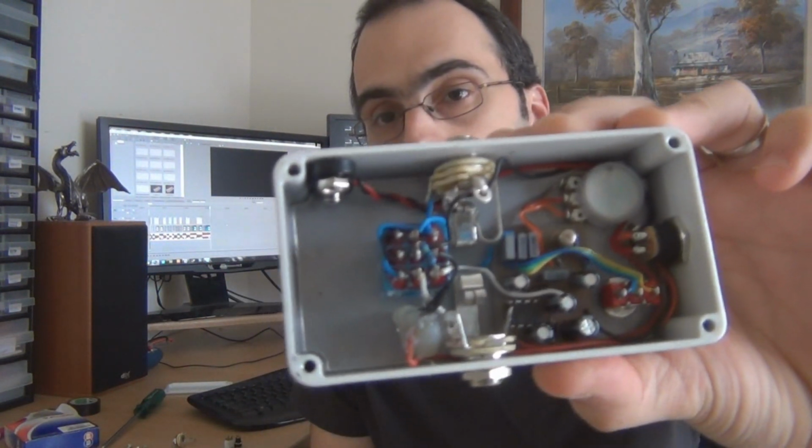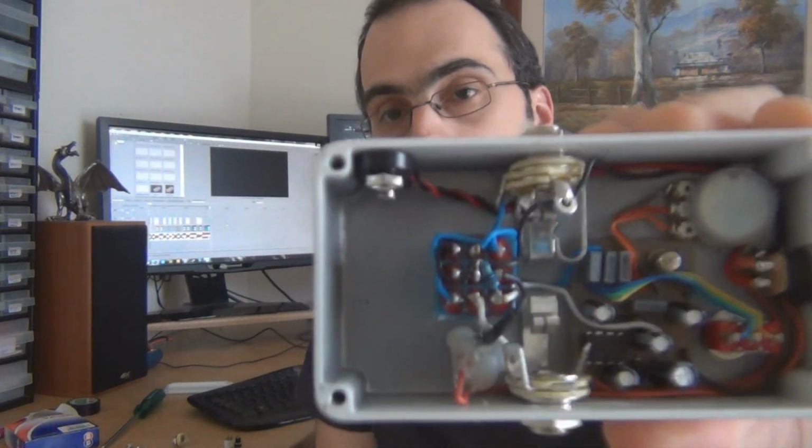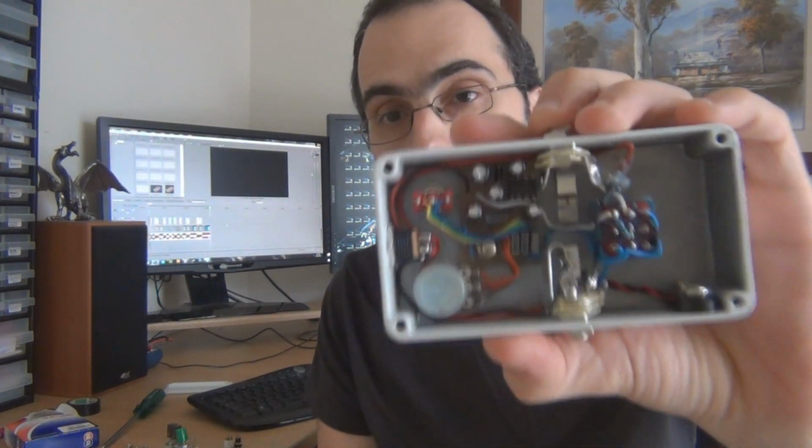Because if you put this complicated device inside this enclosure and wire it up to the hardware without testing it, you're expanding the room for error. If you confirm that your effect works correctly before you wire it up inside an enclosure, you will basically be able to tick off the effect, yep, the effect works fine, and if there's a problem once you've wired it up, you'll know that it was something to do with your off-board wiring that was the problem.